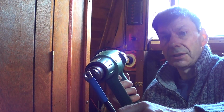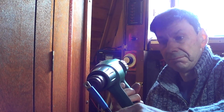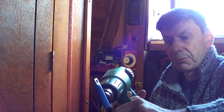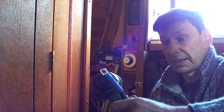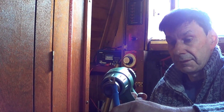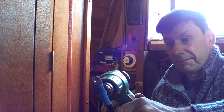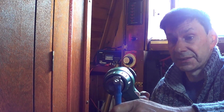Basically, I just take that down and make sure that shrinks over it with a hot air gun. I think they say this helps protect and keep out a certain amount of moisture, which on a boat is no bad thing. Obviously you do get moisture all the time, particularly in this engine compartment. And it also must help it, I'm not going to say hold together, but I think if the worst was to happen and this was to break, you'd hopefully see the heat shrink tear.